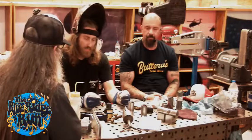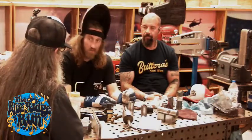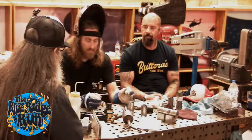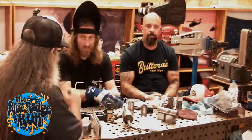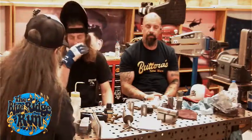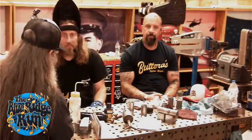And it's more like a stitch. As you move, you want to stay close to the material, but when you go to dab your rod, it's almost a movement of back, lift, dab, lift, dab, backing up. And when you fill, then you move back down. It's almost like back-stitching in general, because you're actually pulling your tungsten back up away from the aluminum. It's because it'll jump on it. It's crazy.